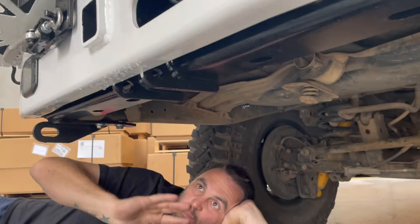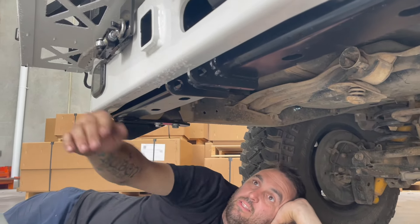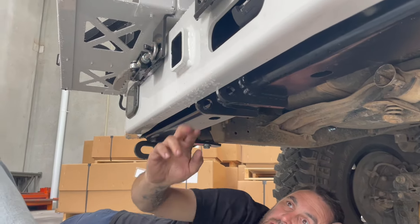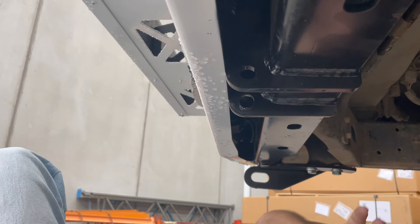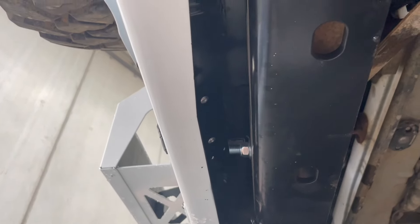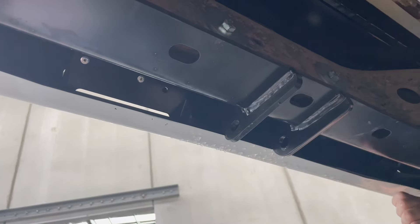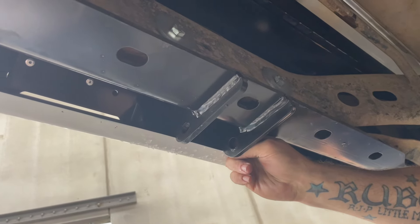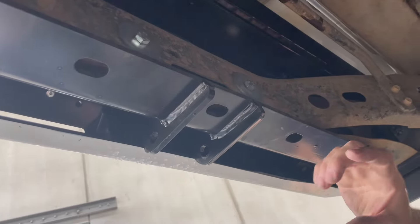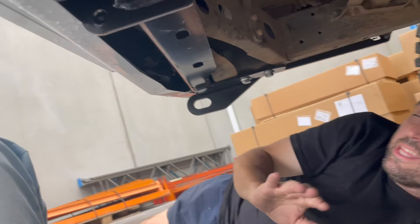This one's just a prototype. Super happy with it — we're going to tweak a couple of tiny dimensions but no one will notice. Hitch through the front, pin up in here. I didn't want a big opening here. I know it makes it fully functional, but if you're dragging it on the ground, a rock grabs a break there and it becomes a peel point. So I wanted to retain this big fold — you can just deal with getting your pin in. It's not like you pull it in and out a hundred times a week, and you can get a quick release pin without the R-clip, so it's super easy. I think that's a cool compromise.